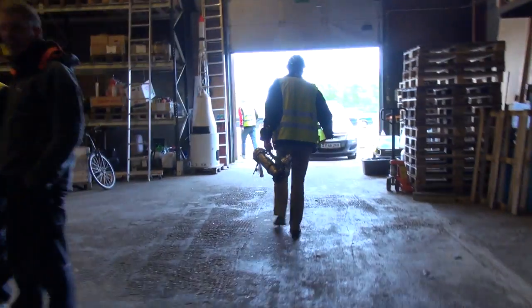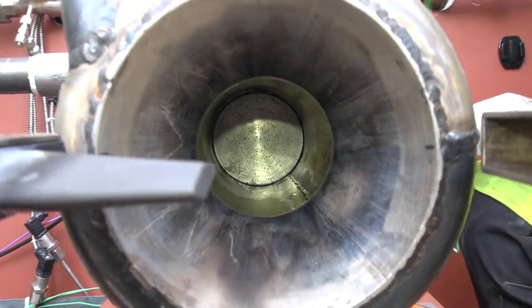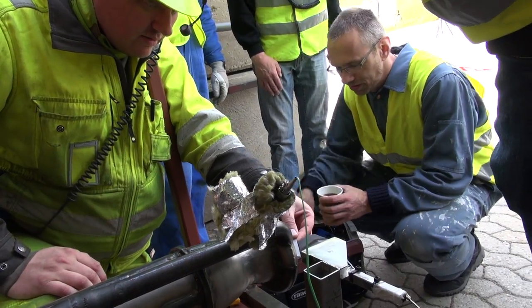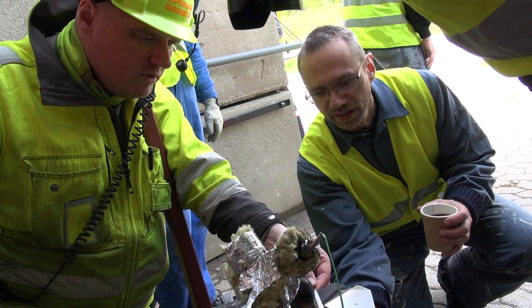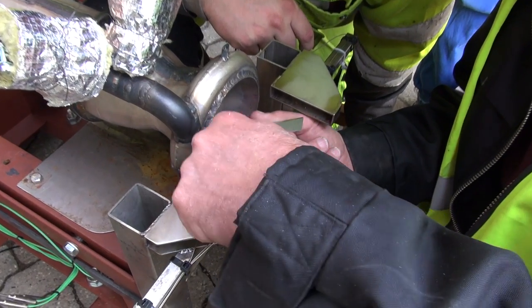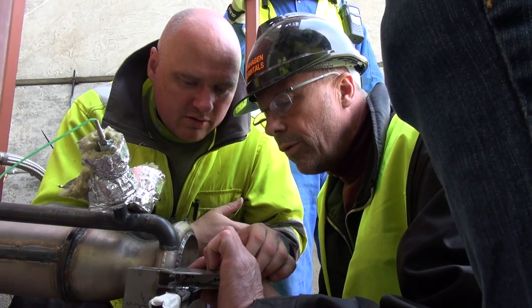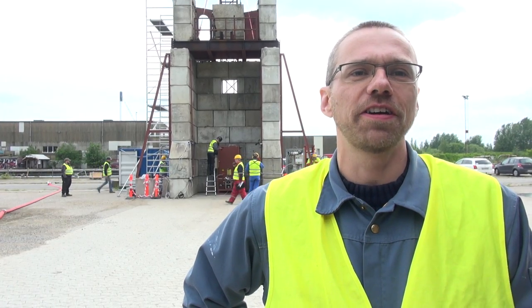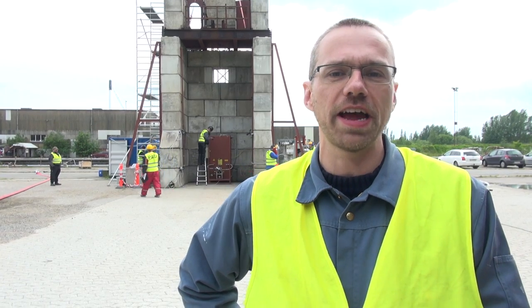After this pressurization process, the pressure kept creeping up, and we take that as a sign that there must have been some leak between the high pressure helium source and the fuel tank. So for that reason, we don't want any creeping pressure, so we won't test the system again today. But we'll go back, take a look at the telemetry, try and figure out whether that was a software or a hardware bug, and work it out.